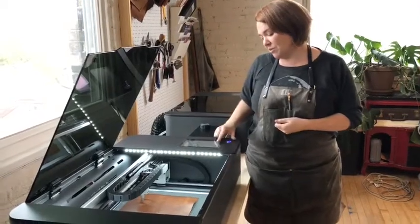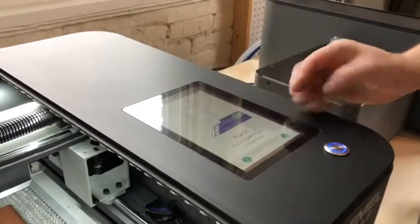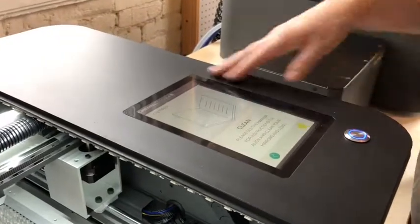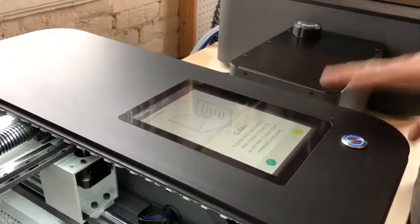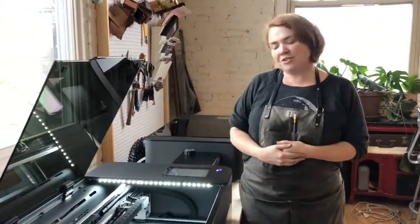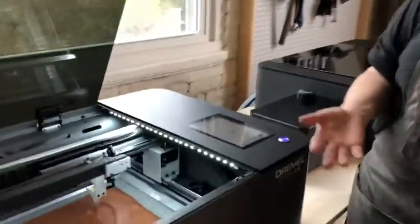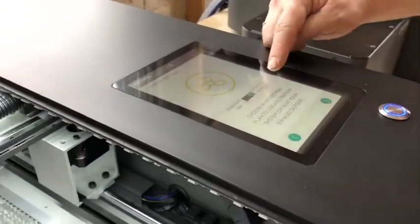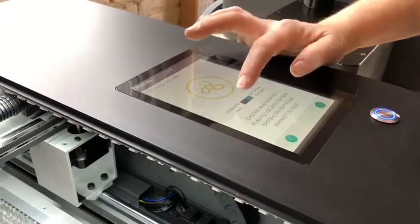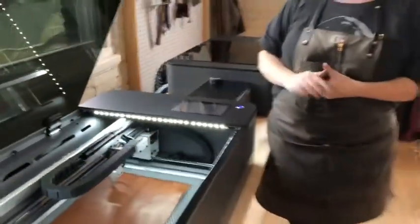After we have the laser focused, we move to the next screen. If you don't remember from watching this video, the screen is going to remind you how to place the puck and how to adjust it. It also reminds you that you always want to keep a clean laser when working — there are instructions in the manual on how to clean your laser. We are going to choose the ventilation system we're using. If you purchased the BOFA box, the ventilation system from Dremel, you choose external system. We're going to use the onboard fan, so we slide that over, select onboard fan, and click next.